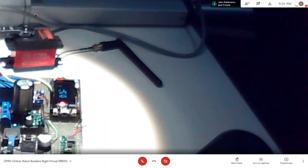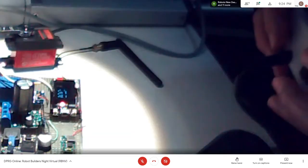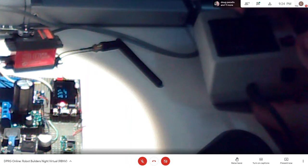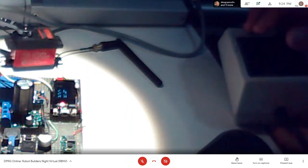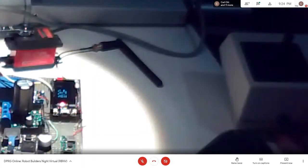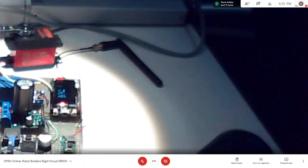So I'm just doing A to D conversion on the analog voltage, and it gives me position feedback, and I use that to position it. If I push the stick, and this one is self-centering, whoops, wrong direction. If I let it go, it snaps back to the straight position. I don't know if I'd call that snapping back. It moves back. It doesn't move very fast. But so that's all working.